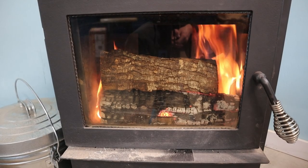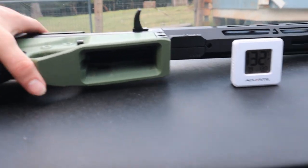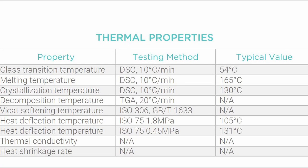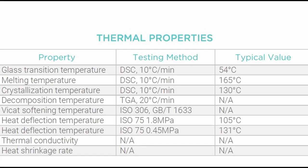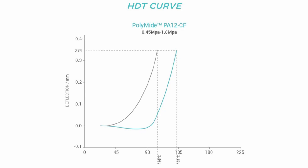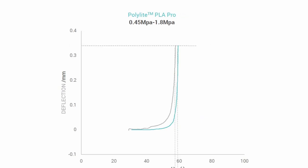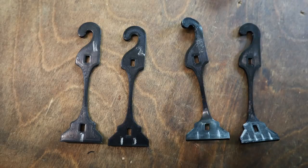There are two areas of concern with this filament. The first is heat resistance. The Polymaker PLA Pro has a heat deflection temperature of about 58 degrees Celsius. The PA-12 carbon fiber has a heat deflection temperature of 105 degrees Celsius, and the PA-6 carbon fiber has a whopping 173 degrees Celsius. However, if you look at the heat deflection temperature curves, the PA-12 begins to deflect at around only 45 degrees Celsius, the PA-6 at around 90 degrees Celsius, and the PLA Pro around 55 degrees Celsius. Even though the PA-12 retains its strength at elevated temperatures, it may begin to creep — and this leads into the next potential problem.